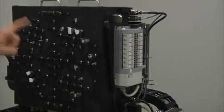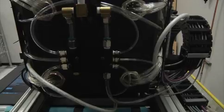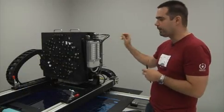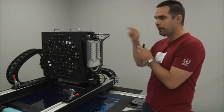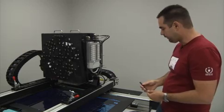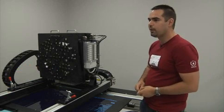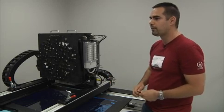And triggering each of these, are they just valves? Or what exactly are you doing? So there's valves on each of the sides that control about 30 or so of the probes each. Okay. And yeah, we can basically turn them on or off, binary, and say, put a probe down. Now, it doesn't give us pressure, but it does give us a binary, I want a finger down or up right now. And you could have all 80 on at once if you wanted to? Yes, absolutely. So if there's a whole army of school children playing with the Surface all at once, you can actually emulate that. And that's the kind of thing we want to simulate. If an army of school children wants to play on it for 24 hours at a time, we want to make sure that we can stand up to that.